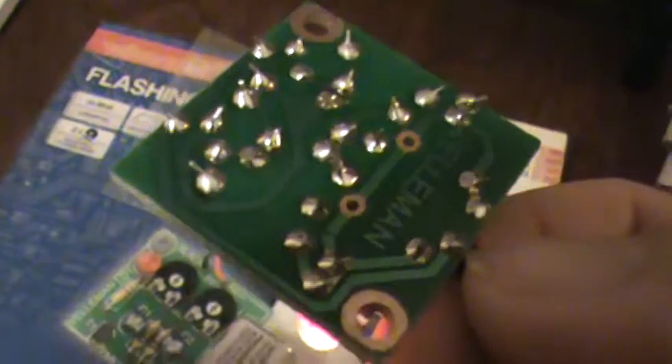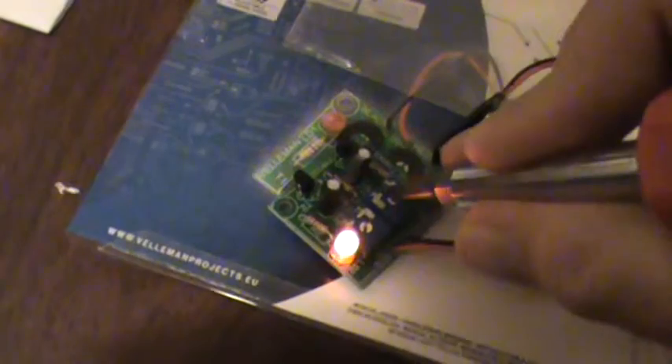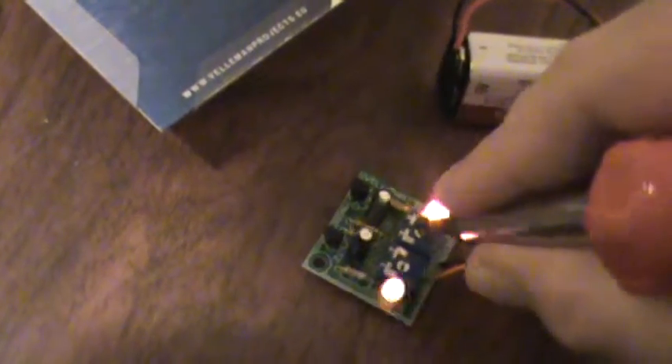Any tips on how I could do better, please comment below. So we made that. And to show you how it tunes — if you twist the dial here, you can see that changed the frequency. Here's the other dial. It really slowed it down. It can also go really fast. So it's an adjustable 2 LED blinker, with the transistors playing off each other.